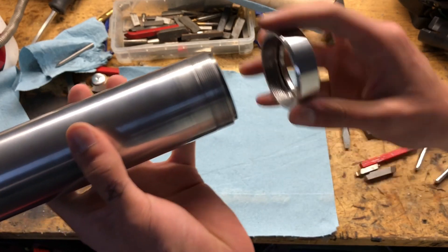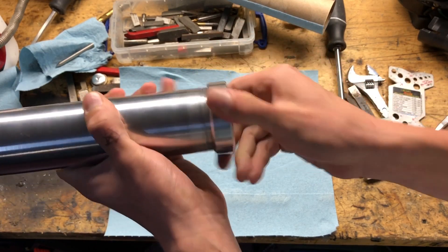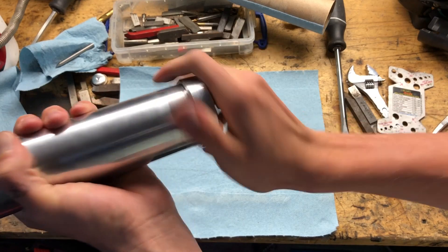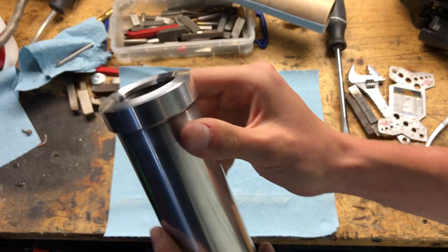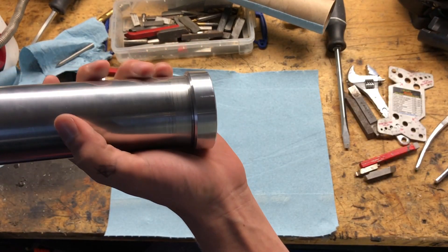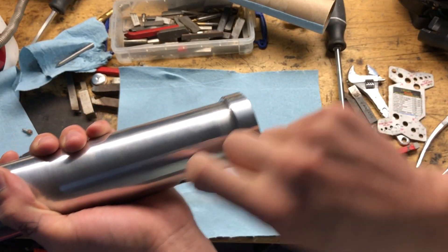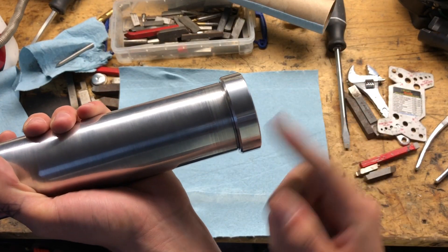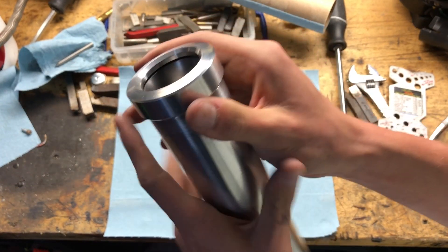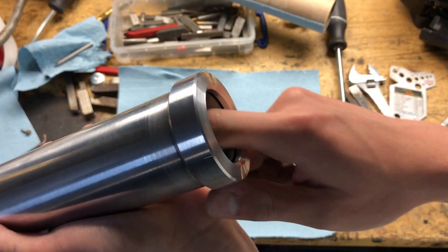As you can see, the nozzle's not all the way in yet, but once you screw the retaining ring on it's a really nice fit — you can feel when it hits the nozzle and you just screw it down until it bottoms out, just like that. There's a nice seal made between the nozzle and the front wall of the retaining ring, so it's sealed both radially and axially. These two o-rings do most of the work, but the chamber pressure also pushes the nozzle forward, further compressing that front seal, which strengthens the whole system.